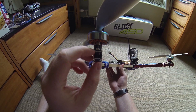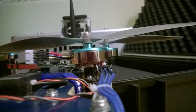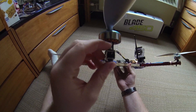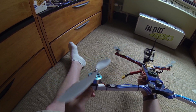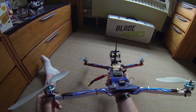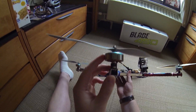You can see there's some bending on the edges, and that's because of torquing down the motor. I was in class, so I asked a friend to drill these for me, and he didn't do a very good job — got it slightly off-center, so whenever I tightened it down, it was squeezing more on one side than the other. Almost all the arms are like that, because they have to be tight enough to hold the motor on but loose enough to not squish the arms too much. Whenever you squish one side, it tilts the motor the other way. I tried bending them back and lining up the motors, but long story short, it just did not work out very well.